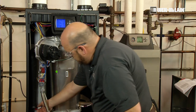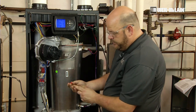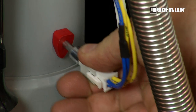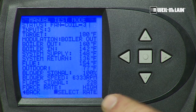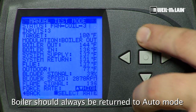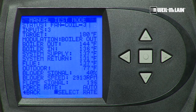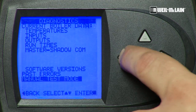While it is cooling back down, we can take our flue temperature sensor grommet off. The point will point down. When we put our probe back in, the boiler can now be forced back into auto rate by pressing the square in manual test mode, scrolling to auto, pressing the square again to save. It is back into automatic mode where we can scroll back to the home screen and allow the boiler to run.